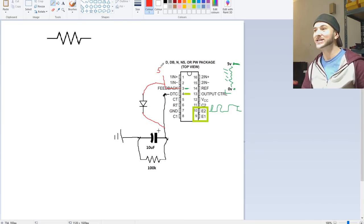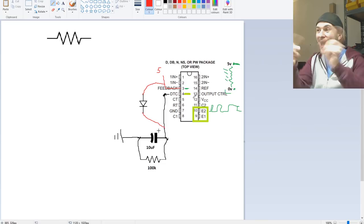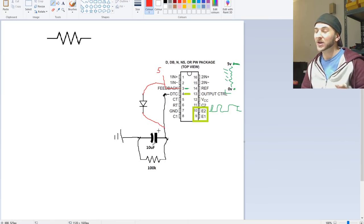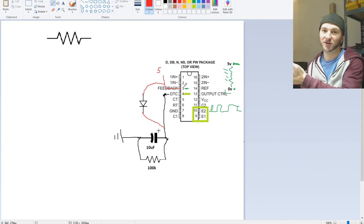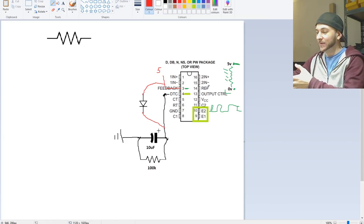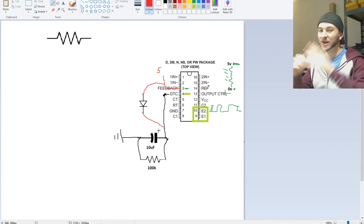So when this capacitor is empty, it will present a kind of short circuit to the 5 volt signal line. So what actually ends up happening is when you try and turn the amplifier on, there's a tiny fraction of a second where the chip activates, because this isn't 5 volts, because it's shorted to try and charge the cap quickly. So there's a brief fraction of a second where it's actually too low. It's like down at 0.5 volts for a fraction of a second. So the chip activates and we get PWM on 9 and 10 at full duty cycle for a brief fraction of a second, until the capacitor is charged enough that 5 volts is able to be on pin 3, which disables the chip. So that means that when you apply the remote, you get a tiny click where the power supply activates for a brief second and then shuts off when 5 volts finally gets its way onto pin 3. And obviously that's not ideal.